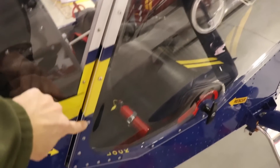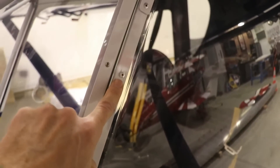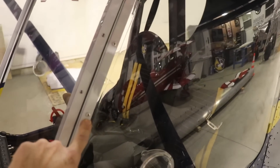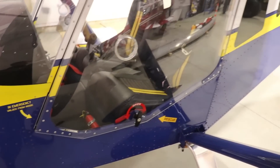And of course the less holes you drill in the glass, the less chance there is for cracks later on. You can see aside from the brackets I have one, two, three, four rivets going down. I've started thinking about whether I want to use rivets or thread and tap the aluminum and use those same 3mm screws again. This square tubing is definitely thick enough to tap. It would be easier if I ever had to replace the glass, but these are pretty soft aluminum rivets that are super easy to drill out. Maybe I'll just use the rivets.